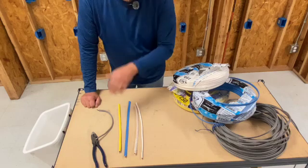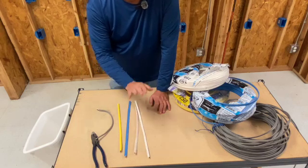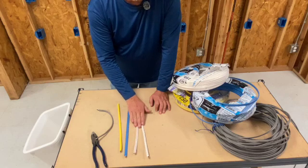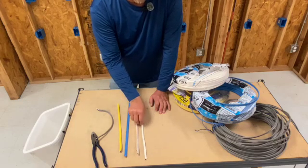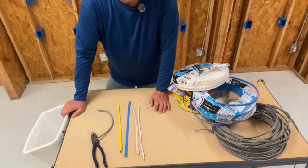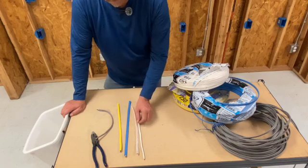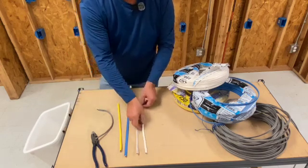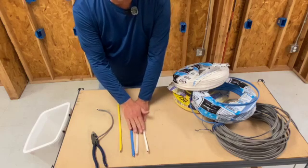Now, if you don't have a blue or a yellow at your supply store or your local big box store and everything is white, you're still all right. This white right here is actually 14 gauge. There's a 14-3 here and a 14-2 here, and all three of these — white, white, blue — are rated to be put on a 15 amp circuit. Don't put it on a 20. That's when we start melting wires, and what comes next is a fire in the house. Then the insurance company shows up asking who was the licensed electrician. If you don't have a permit or any proof, your insurance people will walk away and say it's up to you. So keep your 14s on 15 amp breakers.